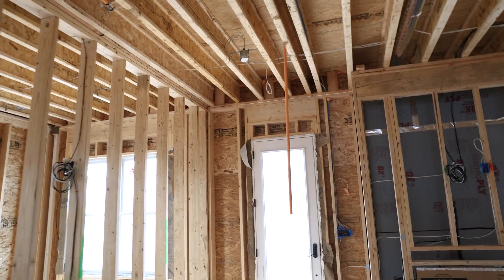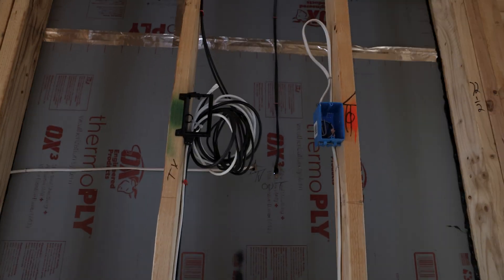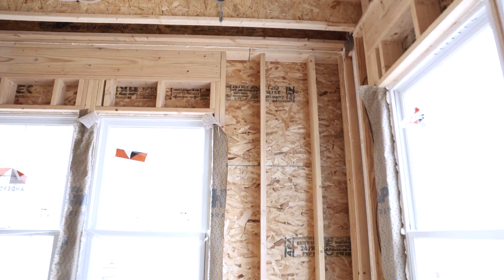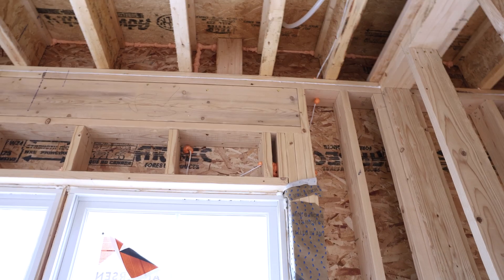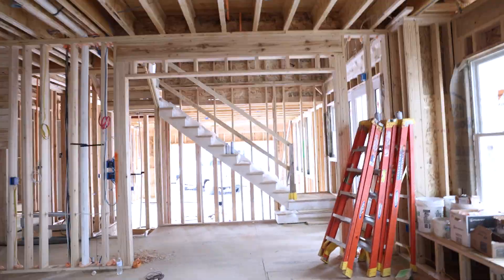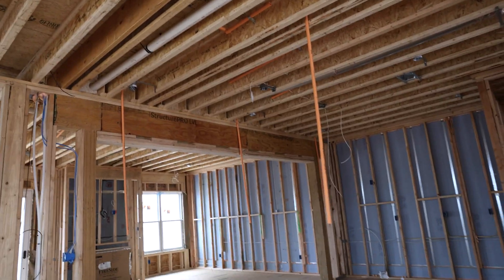Moving to the first floor, we've got all of our jumpers in here. We have our TV wire - each of these TVs got two Cat 6 lines, one for control and one for ethernet, outside and inside. That's all fire foamed. There's our exterior speaker moving through. Another speaker and our deck camera is back here as well - that actually came up from the basement floor instead of going through the ceiling, so since we made another penetration we had to fire foam it. Moving through, kitchen speakers with a set of jumpers, and an access point.